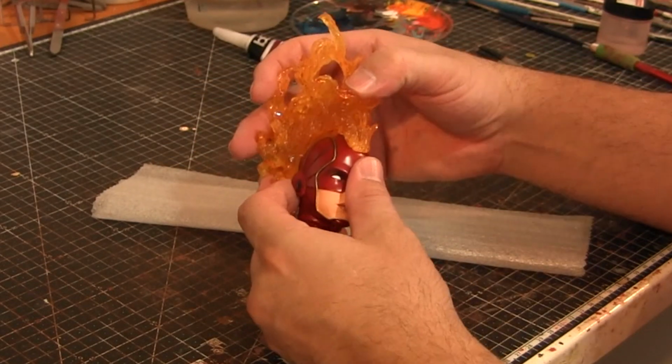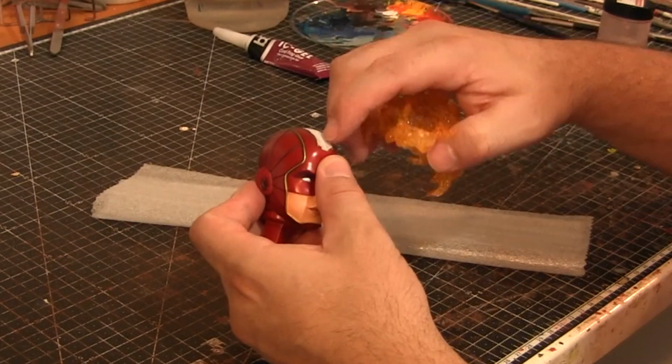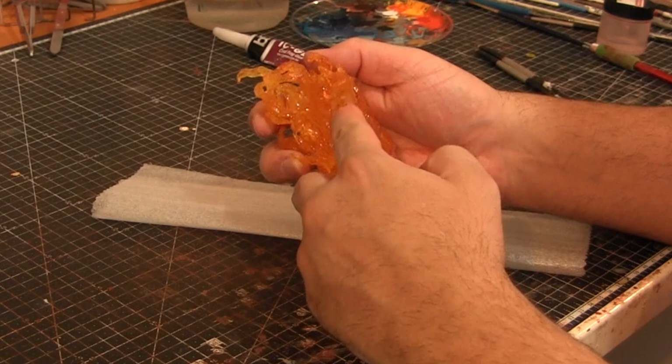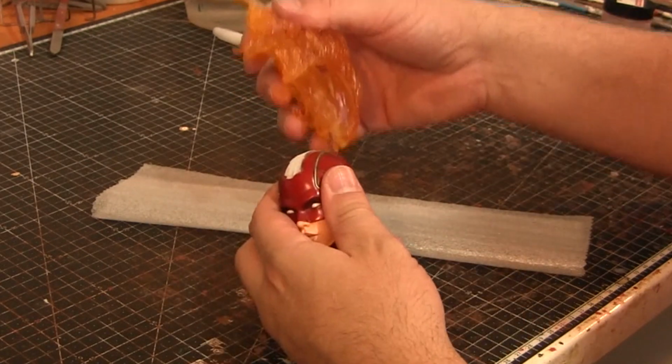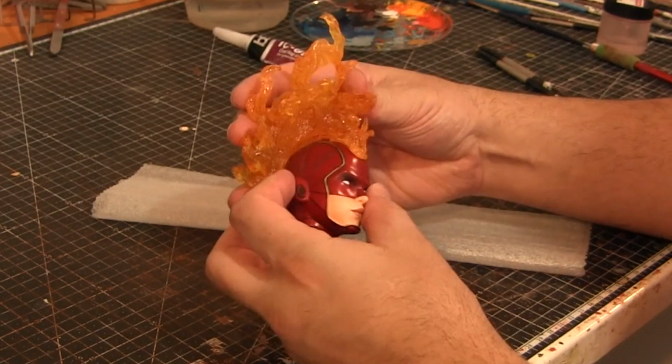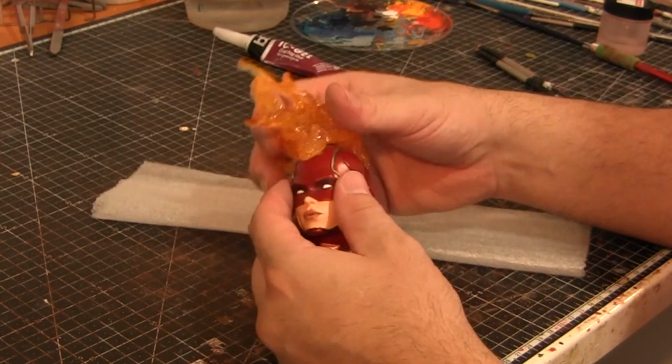And then from there, I'll probably put some notches, some drill bits in here, and clean out this paint that's in here and do some drills in there. This way, when I put the epoxy on, it'll bond together where we want it to. So I don't even think I might have to hit this paint.